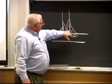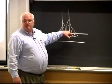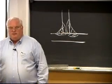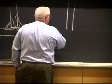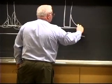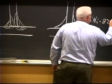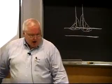If this is thin enough and the erosion or co-melting of the braze alloy with the base material at higher temperatures is severe enough, I could have the whole thing fall apart unless it's fixtured properly in the brazing furnace. And in fact, that's why for many years, actually until about 1982, people used, and this next component I'm going to talk about, the 18% nickel, 82% gold alloy as the braze alloy in these shroud honeycomb assemblies.